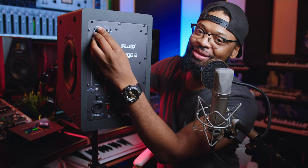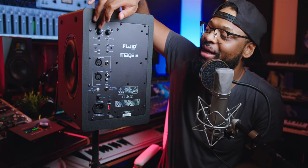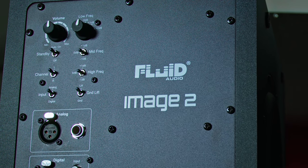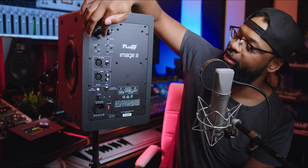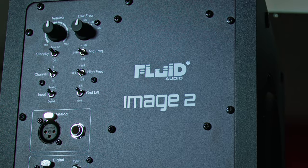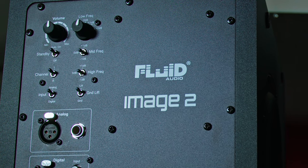At the back panel, we have the volume control. The increments are really close together, so you've got to look carefully at the volume knob to make sure both monitors are matched volume-wise. Next to that is the low frequency control, designed to dial in the amount of bass below 70 Hz — you can crank it up by 1 or 2 dB, or down by negative 1 to negative 2 dB. I have it set to flat. The standby switch I have on auto-on. The mid-frequency switch — set to zero on both monitors — allows you to contour at 2 kHz, with increments of plus or minus 1 dB.